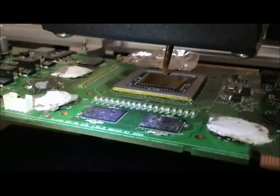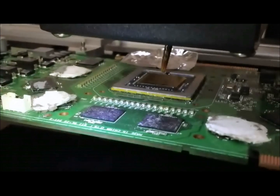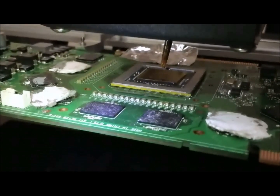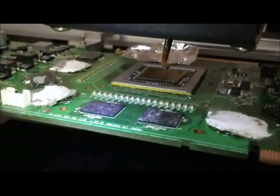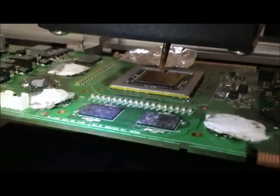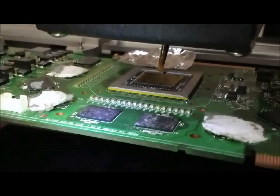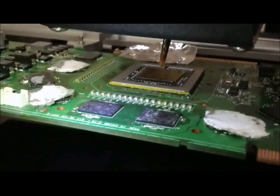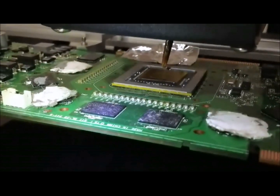So this basically demonstrates the fact that when you're working on a smaller board, you don't need to use as much energy running all four heaters on the bottom — just one in the center. It's quite a large heater in the center so it will do everything on that size board.